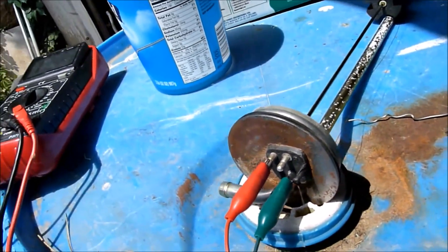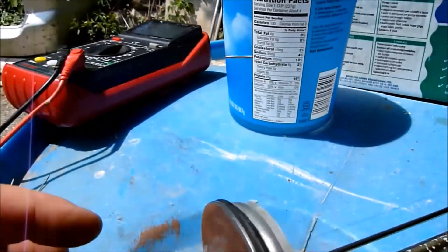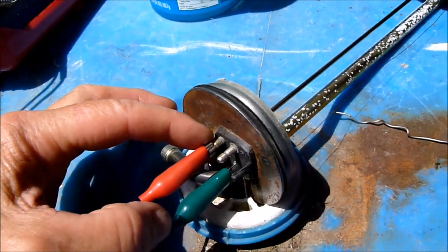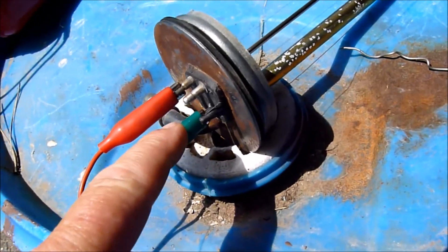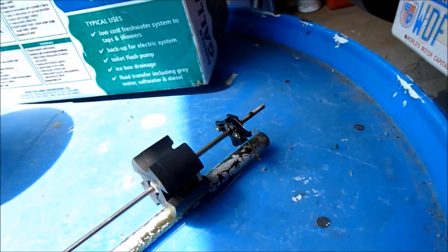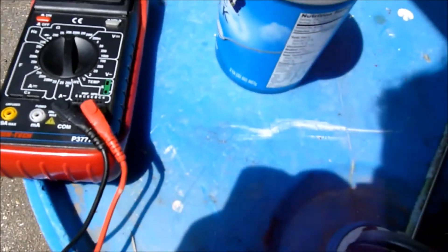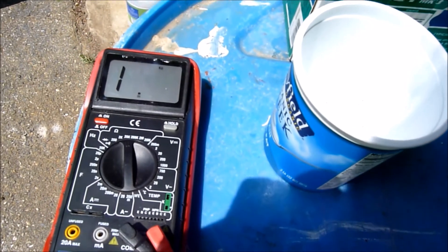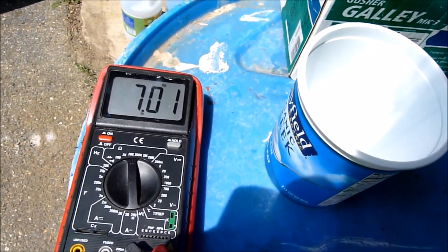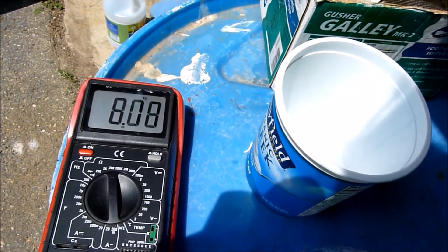We're connected to the reserve light. This pin here is ground. This is the copper wire that goes to the connection that I just soldered back on again. And it turns out there's a lot of resistance here — the best I can get is about 7 kilo ohms, which is way too much to turn a light on.